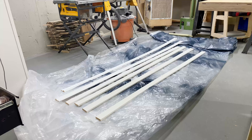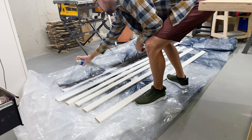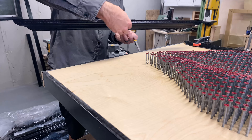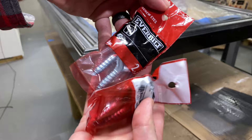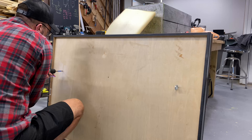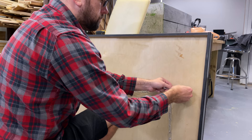To finish this off, I needed to make a frame for the entire piece. So I went and bought some pre-finished white trim from the store and painted it black to help cover up the plywood edge. This flat trim covers around the edge. Then I added a chair rail just to make a nice decorative border on top. I painted this black originally, but afterwards I wasn't happy with that, so I went back and added some gray texture to make it look like steel or stone — the black was just too black. To hang this, I got some pretty hefty hardware because it's probably coming in close to 50 to 60 pounds all said and done. I did end up having to reposition these hooks once we got into the gallery space, putting them closer to the actual top of the frame.